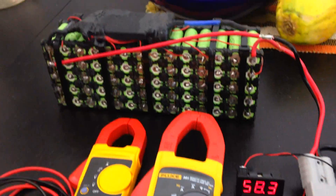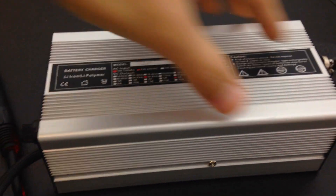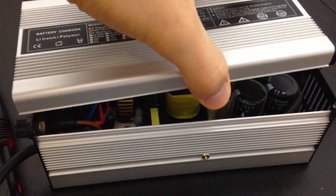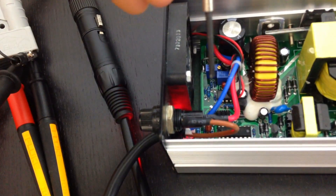So for this test I'll actually have to make some changes — modifications to the voltage in my charger. This is my six-amp charger. I'm going to open it up; it's just one screw in each corner. Then I'm going to locate the trimmer pot. So this is what the trimmer pot looks like — this is the thing here.